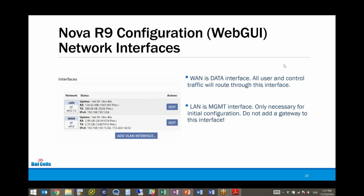There's other metrics too, like the SINR, CNR. For the SINR, I think generally 10 is a good number to start thinking of cutting it off at that point. But we actually show the MCS levels, which I don't think other vendors do. So you can actually see what you're actually pulling. For those that don't know, 28 MCS is the best you can reach on the downlink, and 22 is the best on the uplink.